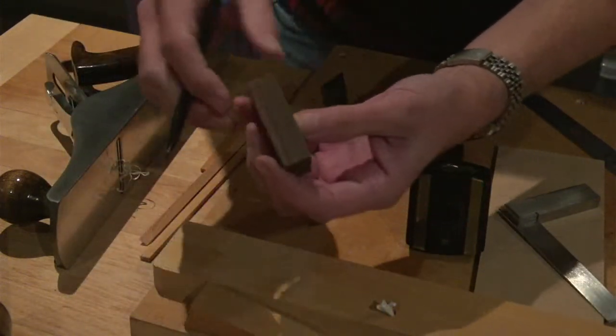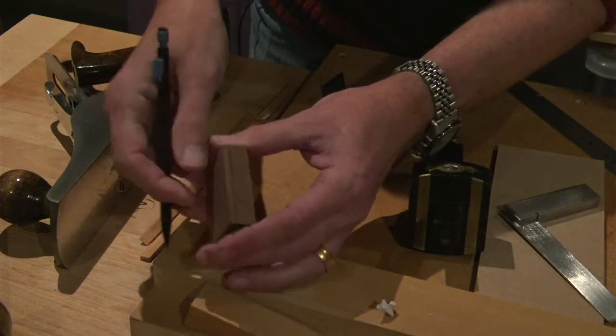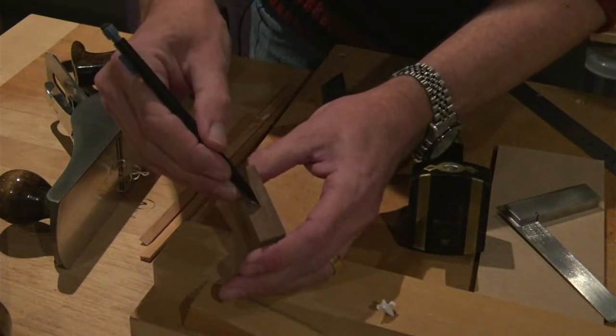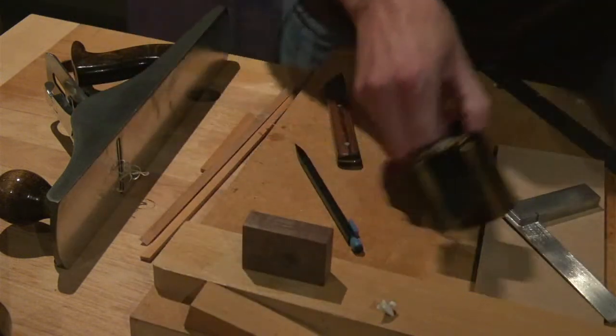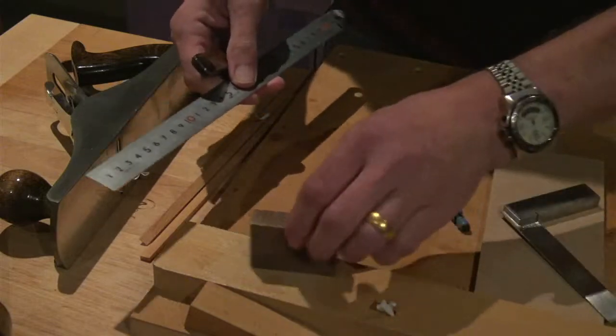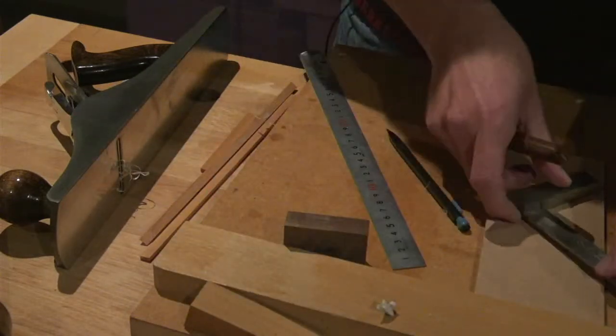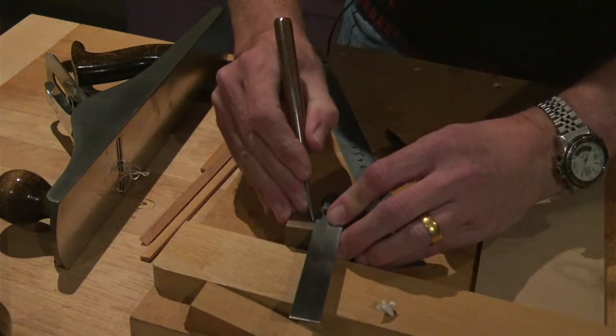It's quite difficult to see. I should have picked a lighter wood like I did on Monday. That's the mortise we've got to chop out. The one slightly longer than the other. Now that I've used the mortise gauge, I'll come back with a knife and just square the ends of the mortise in. Just a little reference for the chisel.